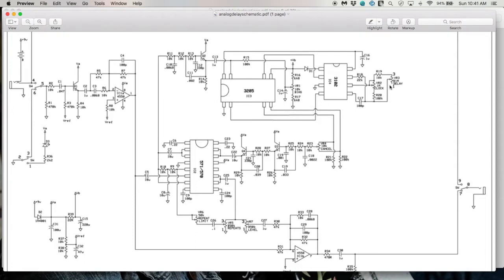Now the cool thing about this sort of circuitry is that when you turn the delay control, it changes the clock in real time. And that means that the signal being pulled out of this delay chip was initially recorded at a different clock rate than the one it's being pulled out at right now. That creates the funky pitch shifting effects that you hear when you turn this knob. So that's kind of neat. As I mentioned before, from there the delayed signal comes through here and then out to this mixing bus right there. This compander is one of the reasons why analog effects sound the way they do, a little bit lo-fi, that and the fact that the frequency response of this delay line changes depending on how you set the delay, because the rate at which you're sampling changes.